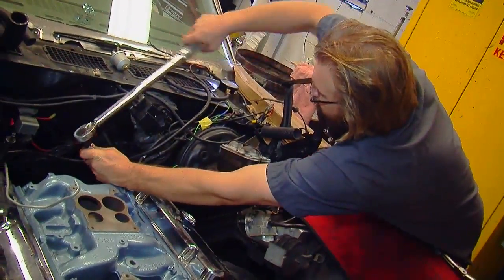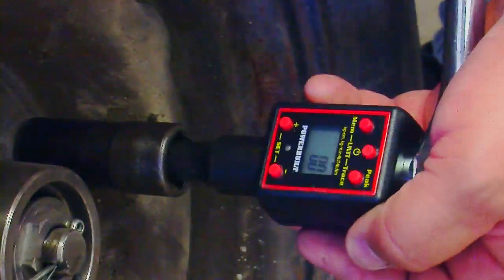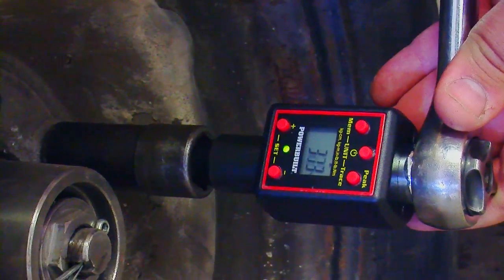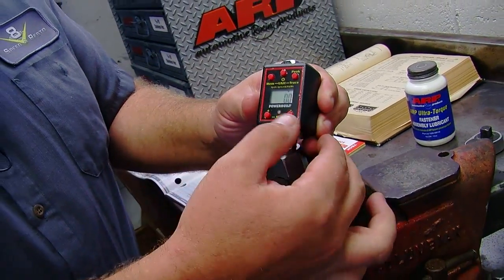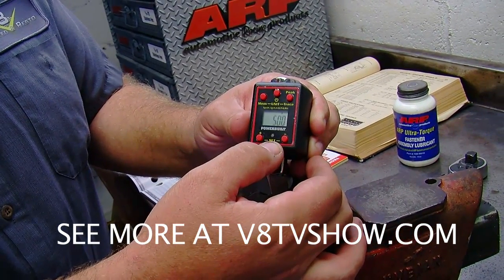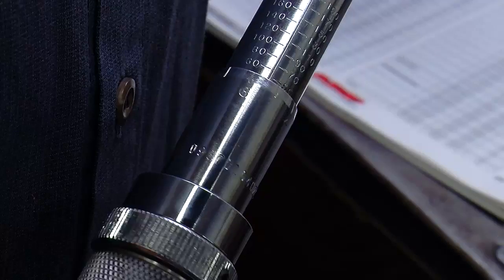The first question is: is your torque wrench accurate? This little device is kind of cool — it's a digital torque adapter, and it allows you to turn any wrench into a torque wrench. You connect one side to the wrench and the other side to your socket, and it has a digital readout that shows you the torque rating as you're tightening a fastener. In our case we've preset this one to 50 foot-pounds of torque, shown flashing on the display. You can also use it to check the accuracy of your torque wrench, and it comes with an adapter to put in the vise.